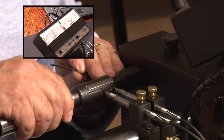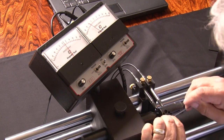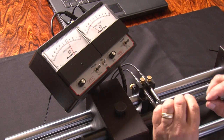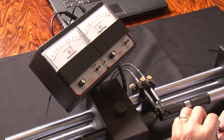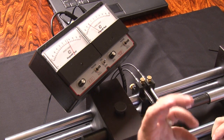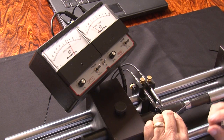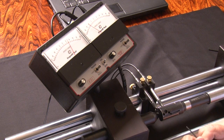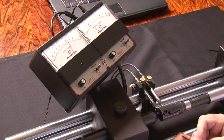Make sure you're on your high point. Get your cut diameter anywhere from about two to four tenths — that's fine for most applications. You don't have to have it exactly. Remember we're talking in tenths or microns. And anywhere from about three to seven tenths below on the back taper will work for most applications.